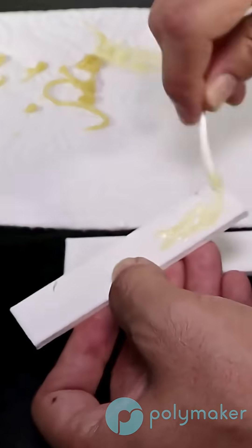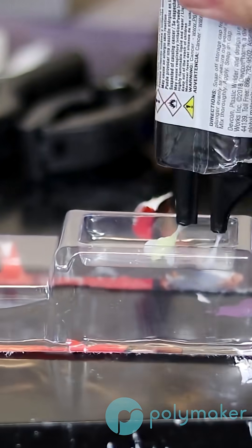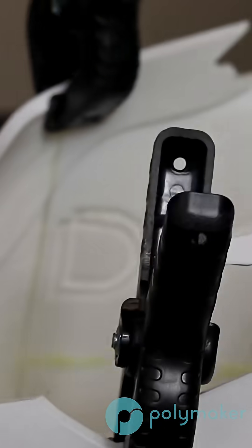There are also plastic welders like Devcon Plastic Welder, which do work great. It is a two-part epoxy, but it takes a lot longer to dry, so you will need to clamp your two prints together with a vice of some sort. I have also found great success from JB Weld if you need to adhere a plastic PLA print to something metal.